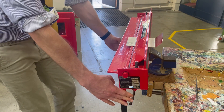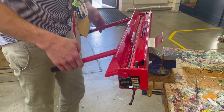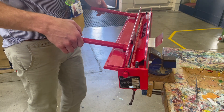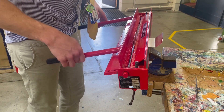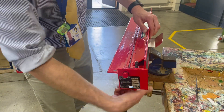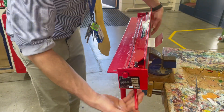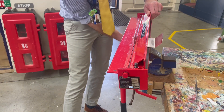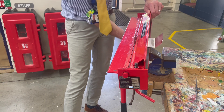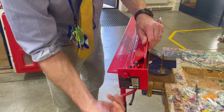Then using the handles I just lift the metal up to achieve the angle I want, going in gradual steps so I'm not going too far. Let's say I was trying to do 90 degrees — I'll just do it and eventually when I'm happy I will unscrew the clamp part. Sometimes you have to completely undo this in order to wriggle it out, but it will go eventually.